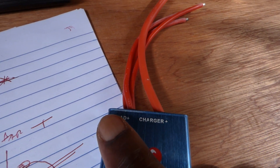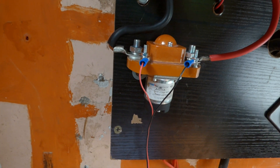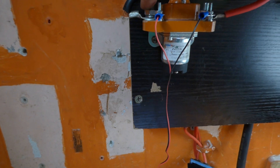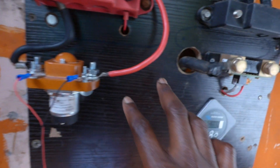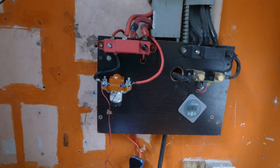Looking at the wiring: there is charger-plus, load-minus, to-BMS, and to-battery. The charger-plus side comes to the output side of your contactor, and from your bus bar — your charging source — it comes into the input side of the contactor. Then you take your two signal wires and put the positive on the first side corresponding to where it comes in, and negative to the outside where it goes out. Once it exceeds your set voltage, you hear a clicking/snapping sound and it stops charging. You can connect a second one to also stop discharging.